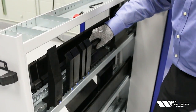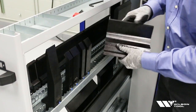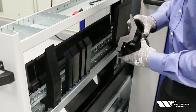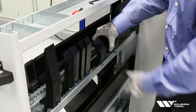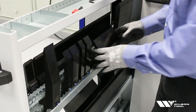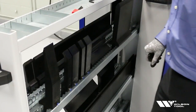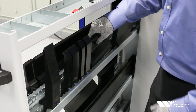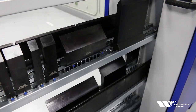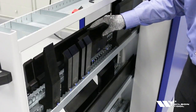This punch is more of a gooseneck style, and that gooseneck has a lot more on one side of the center line than the other. You'll notice these punches all have the tool marking on the outside because they're fairly symmetric, but because this one has more on one side, if I load it facing this way and run my drawer closed, it'll run into the next drawer. For something more off-center you have a couple of options: you can store it the other way, or adjust the center track so the punch fits and you can still use the other tracks for additional items.